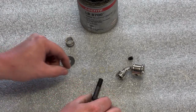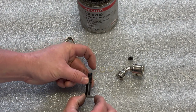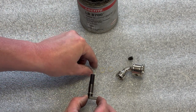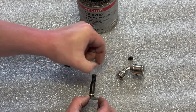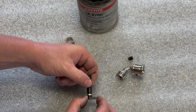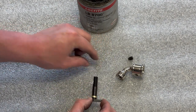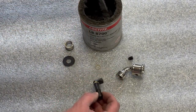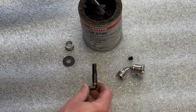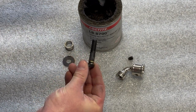I'll start by adding three of the four included latch spacers onto the latch shaft. The more spacers you use, the further inward the latch foot will go. If the latch doesn't grab using three spacers, disassemble it and add the fourth. Next, a small dab of grease gets applied to the latch shaft — this will keep the shaft lubricated and operating smoothly. Apply it only to the smooth portion, not the threads.